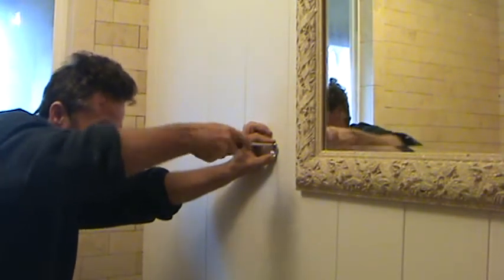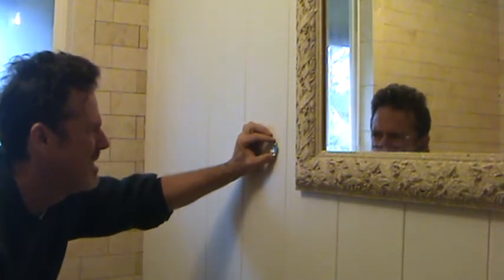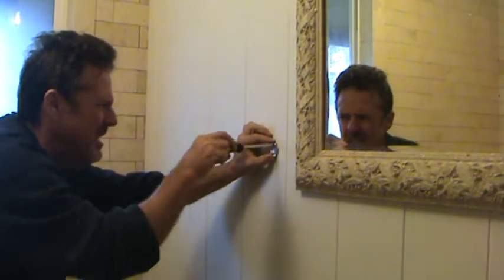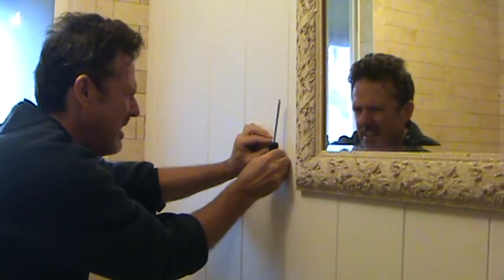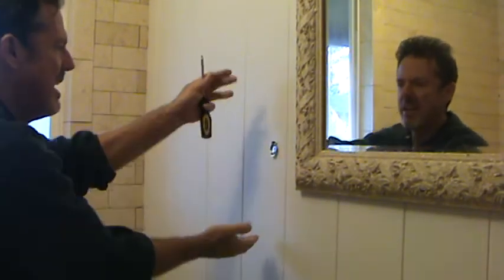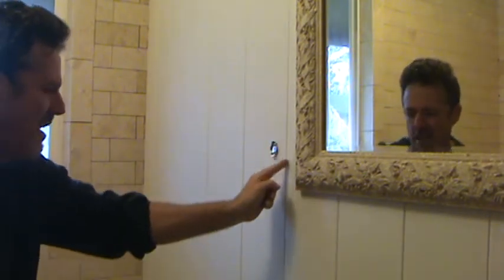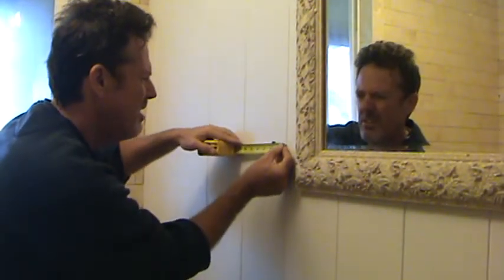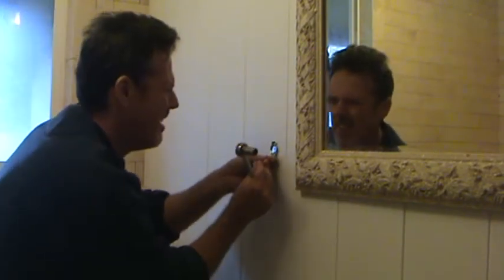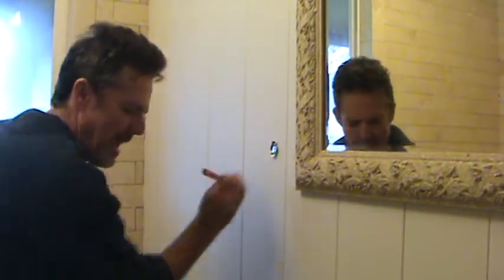Small little projects like this are really easy to do — if you don't do it, who is? I'm going to slide this up and down and position it right in the middle so I can still make adjustments. If I put it all the way down and screw it in, I don't have any adjustment for up and down — especially useful if you're doing a towel bar and need one side up just a hair. I can eyeball it, and it looks straight. I could also measure off that with a tape measure if you really want. I put the mark right in the middle and now I'll go ahead and screw that last one in nice and easy.